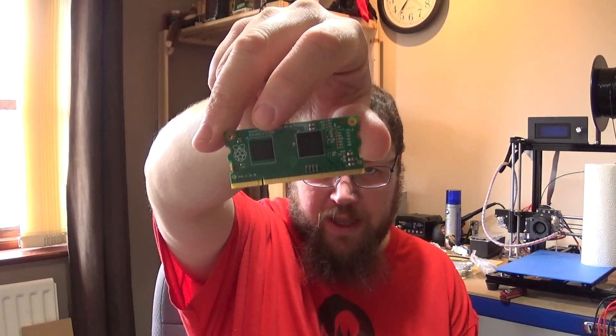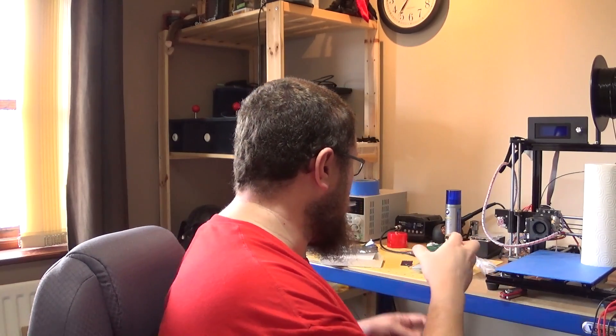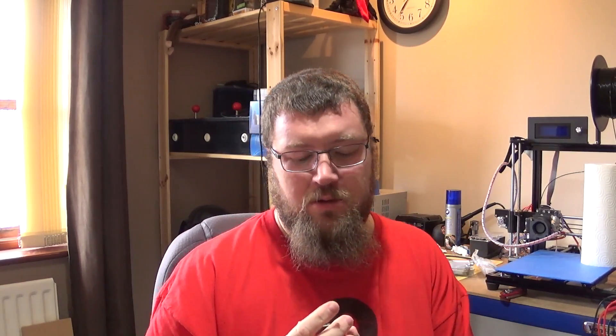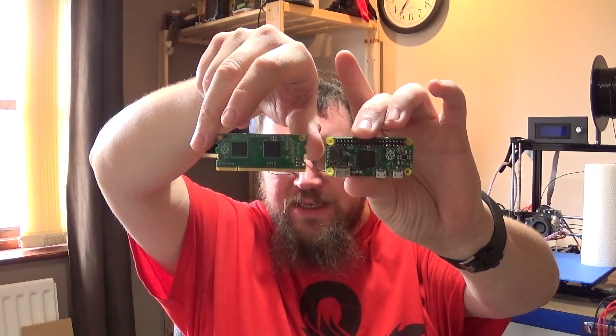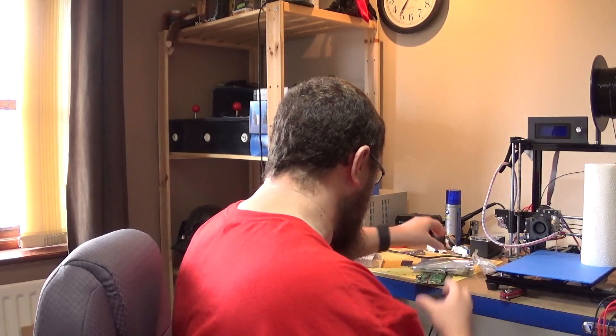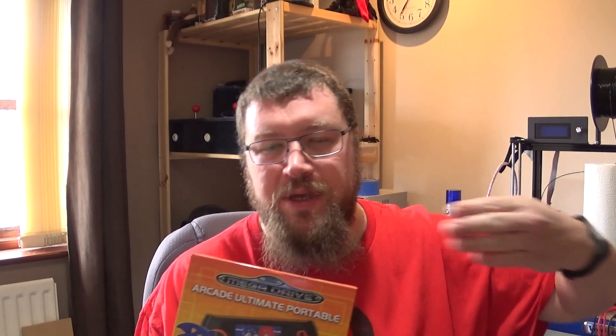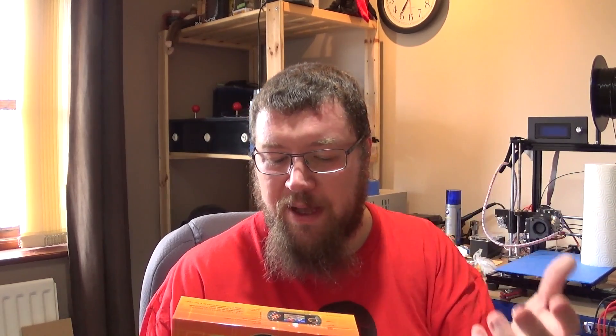What I thought about using was the Raspberry Pi Compute Module. The Pi Zero is roughly the same size and has for many hobbyists replaced the need for it. However, the advantage with the Compute Module is that I get to determine where all the connections go — I design the PCB, I design where all my things go. In the case of stuffing a Raspberry Pi into this device, if I design a carrier PCB for the Compute Module, I can have one single PCB with all of the connections and all of the parts I need on there.